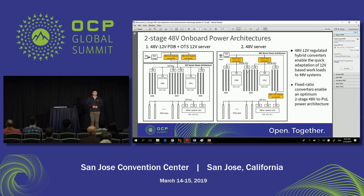We came up with a two-stage strategy: we can leverage a lot from the 12V power solutions available in the industry for the second stage, and focus on advancing the first stage to develop more TCO-effective DC-to-DC power solutions. This slide shows two typical application scenarios where the two-stage strategy fits very well. The first is using a 48-volt to 12-volt regulated power distribution board to interface the 48-volt rack with a 12-volt off-the-shelf machine. The second is a 48-volt-powered motherboard with 48-volt DC-to-DC converters on-board.